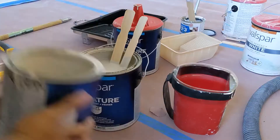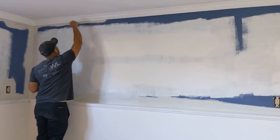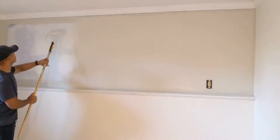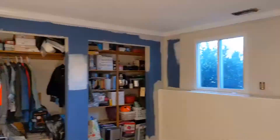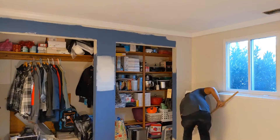I'm doing a two-tone color in this room using Agreeable Gray by Sherwin-Williams, which I've used in other parts of this house. I'm mixing leftover with a new can just in case there's color variation between the two. To cut in I'm using a two-inch brush — this is actually my first time freehand cutting in. Normally I use blue painters tape, but I think I did okay here. After cutting in I did a normal rolling technique, just a straight-up W. I went in with a second coat to make sure I had full coverage.